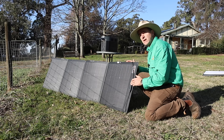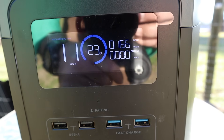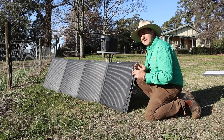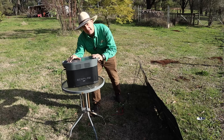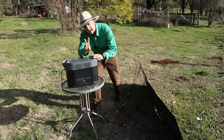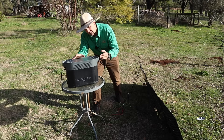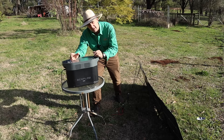These panels are rated at 220 watts. We're in early morning winter sun here in Victoria, Australia, quite a distance from the equator, and we're still pulling around 160 to 170 watts of power. It's telling me that to fully charge the battery it'll take 11 hours. We've probably got about 10 hours of sunlight in a standard day, so you can run your fridge all night, charge all day, and maintain a reasonable equilibrium.